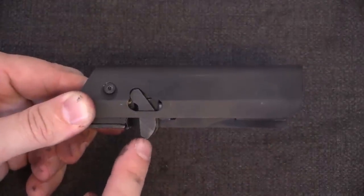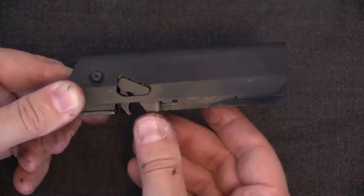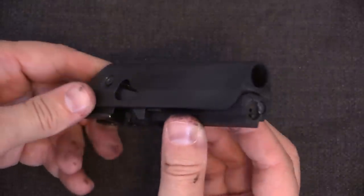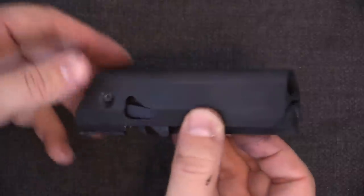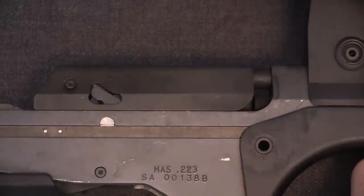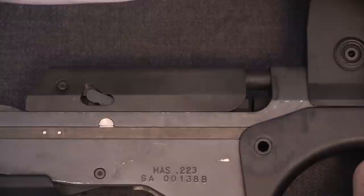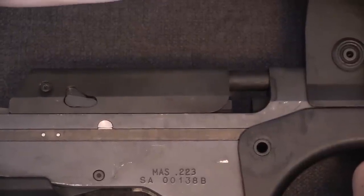The lower fulcrum arm of the accelerator lever remains locked in the receiver until the bolt carrier has moved a substantial distance, much farther than the distance that the bolt itself has moved during that same time. This ensures that the cartridge remains in the chamber long enough for pressure to drop to a safe level. Thus, as the bolt carrier begins to move, the bolt remains virtually entirely closed, safely containing pressure from firing. Note how far open the fulcrum lever requires the bolt carrier to go before the bolt itself starts moving here.